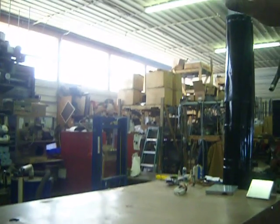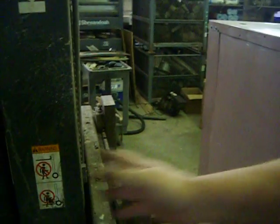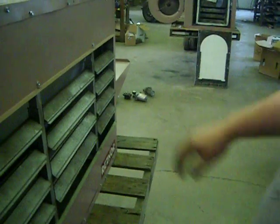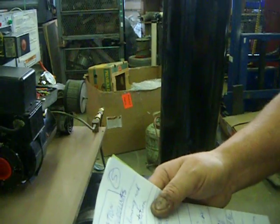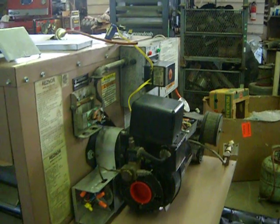We normally put 3 foot above the furnace for fire protection, 3 foot on the end of the furnace for cleaning purposes, plenty of room on the front for the hot air to blow out, room on the back to suck cold air in, and room on this end to service anything you need to service, 3 foot in all directions. It also needs to be 8 foot off the floor.